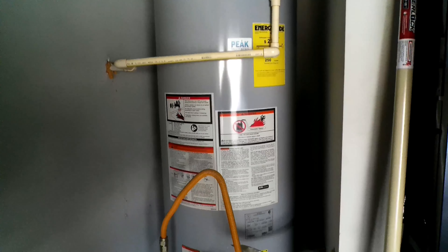But you can't just rely on the labels alone. One of the best ways to tell which is your cold and which is your hot pipe is to actually feel it. If you have insulation on the pipes, remove it or go around it and feel the pipe. You can feel whether it's hot or cold. On top of that, the cold pipe has a shutoff valve attached to it — this is the pipe you would shut off when you're ready to flush your water heater.